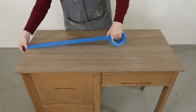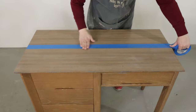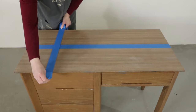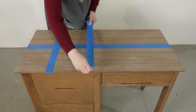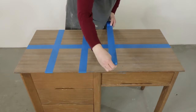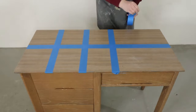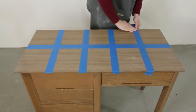Then I taped off the laminate into sections, right down the middle on the line of sanded and not sanded. Then I taped each half into five of their own sections. The first section was for no primer, the next for the Bin shellac-based primer, the next for clear shellac, then the Bullseye 1-2-3 primer tinted grey, and the last section for Country Chic Paint's clear bonding primer.